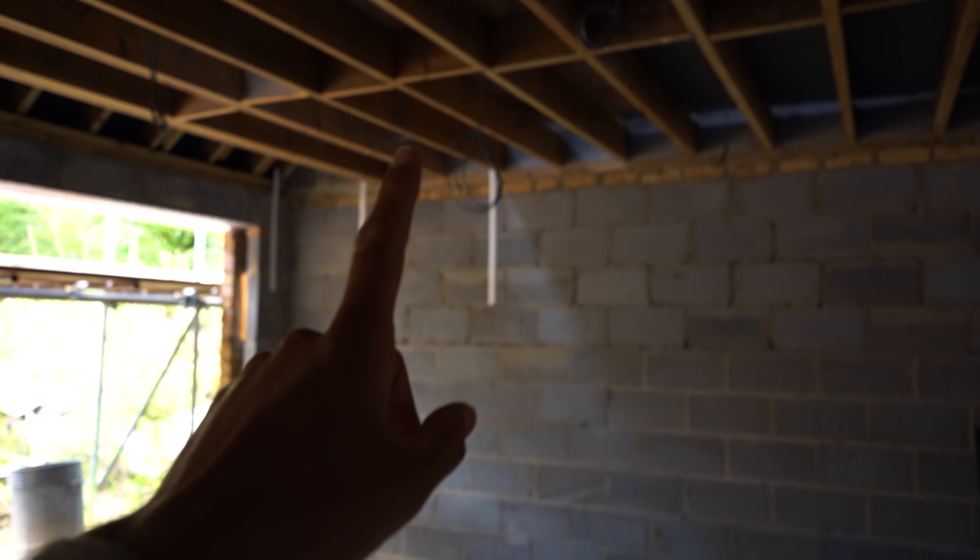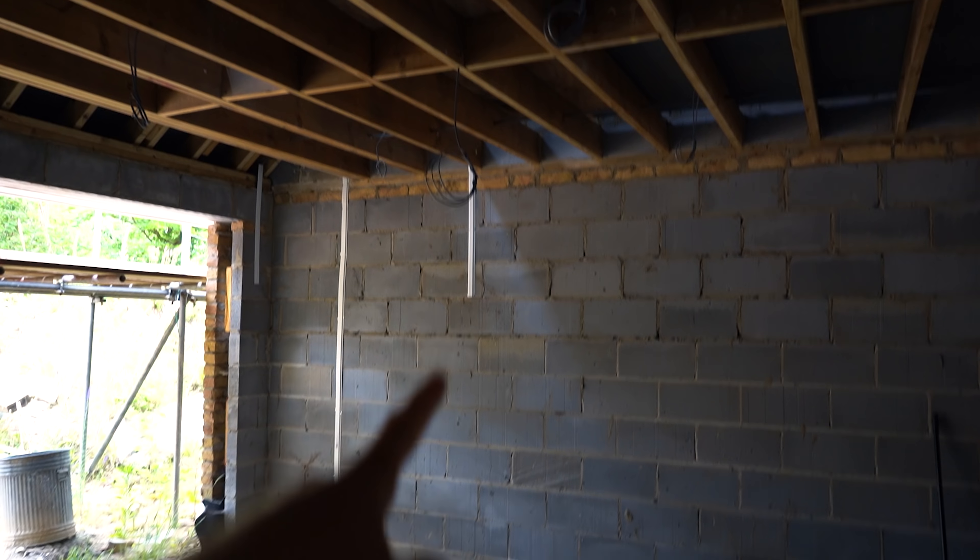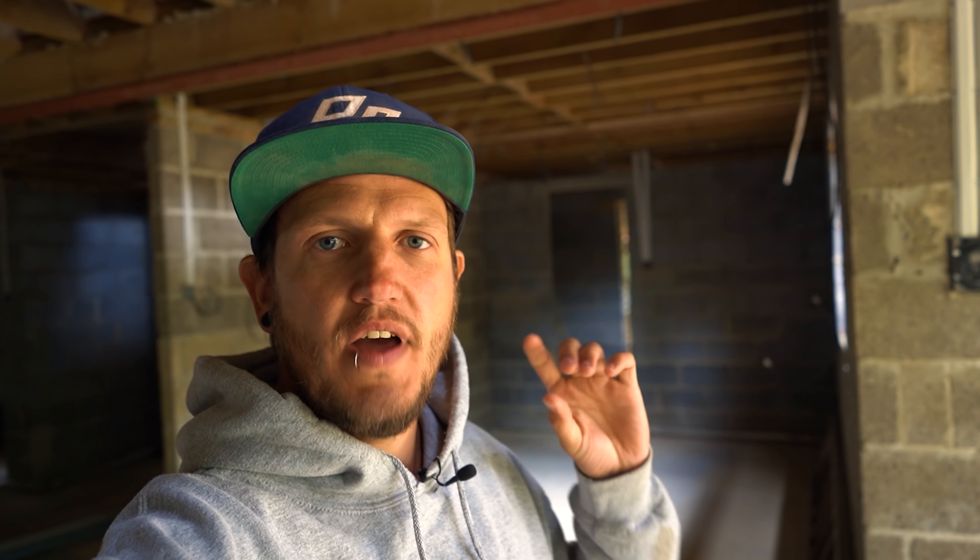So hopefully that was a quick rundown of the electrics and what's happened. You can see the run of cables coming down here - we're going to have spotlights all through here, but we are going to have one downlight over the large dining table, and it'll be one of the ones where you can plug in and plug off if you don't want the pendant over the table. So that is all of the first fix electrics done, apart from the kitchen - I have to hear back from my kitchen designer about where all the units are going to go, so we know where all the plugs can go.